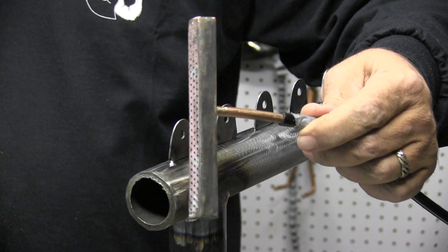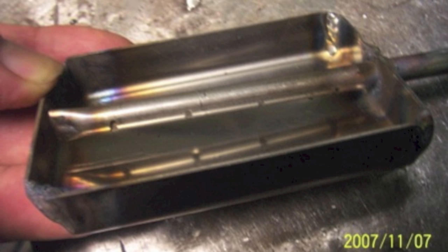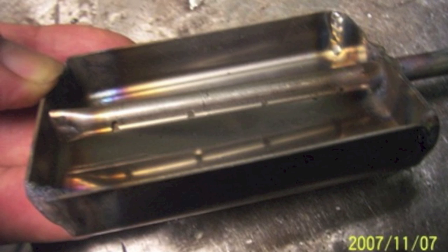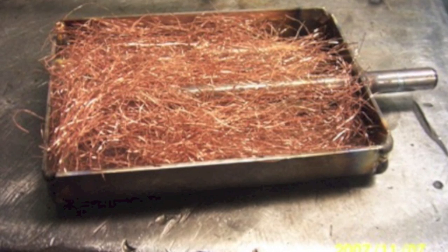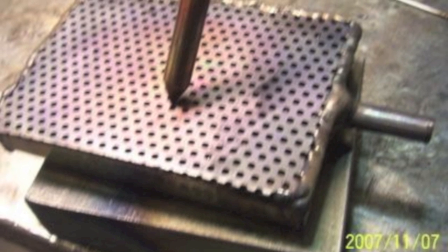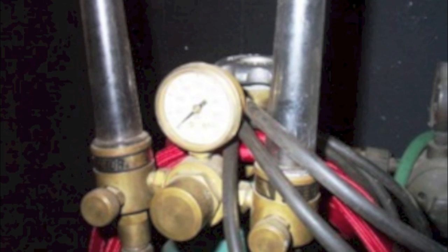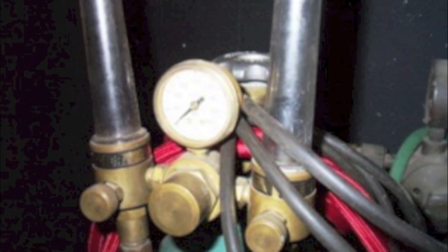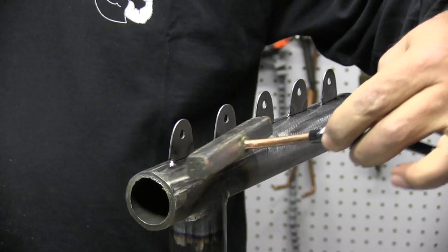Because we're going to weld one side of these tabs, I'm going to talk about getting purge gas to the back side using a little purge box. Basically you've got a tube running up inside a box with slots cut in the back side of the tube so that argon goes around and gets diffused by some type of diffuser material — in this case it's copper wool. You could also use a copper scouring pad and a piece of perforated copper on top. You need a dual flow meter or a separate argon tank with a flow meter — you really need a separate line for purge gas.